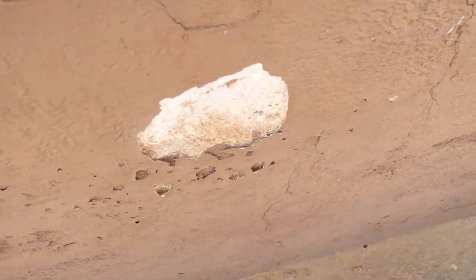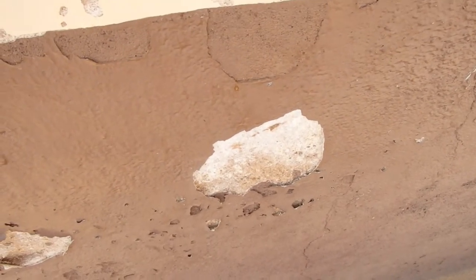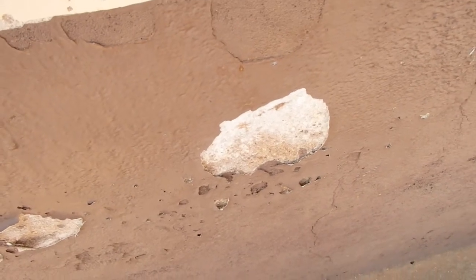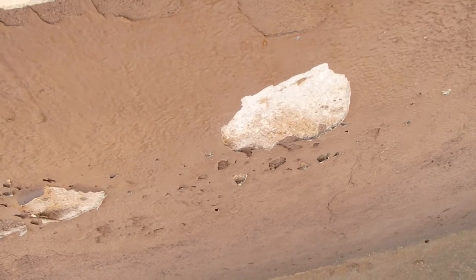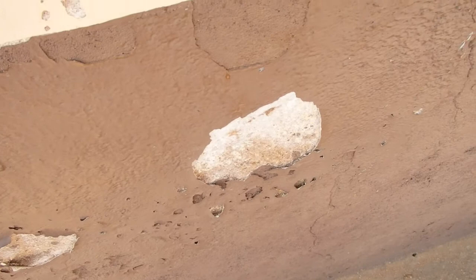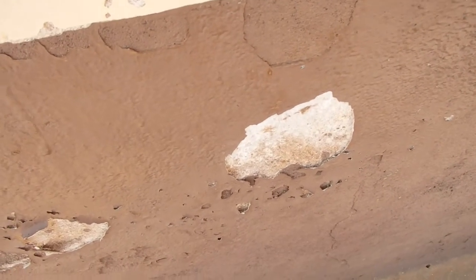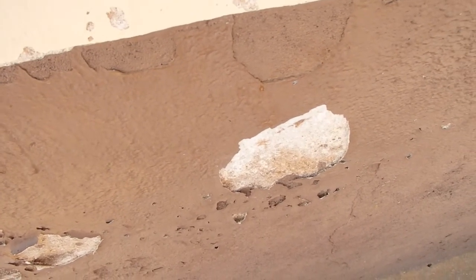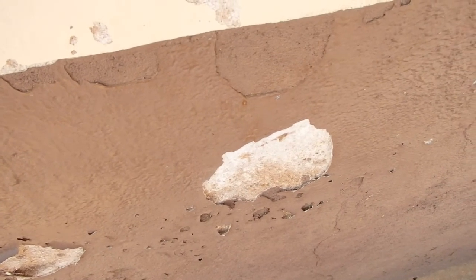So what you find is that it starts to flake off over time, and it normally doesn't take very long for that to happen. The reason is that as latex or emulsion-based paints form that hard layer over the surface, the concrete is still off-gassing or getting rid of water through its strengthening process — it does that for around 21 days. As the water tries to leave the concrete, it gets in behind that hard cover of the latex paint and basically peels it away from the wall.